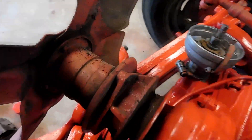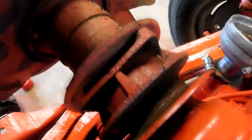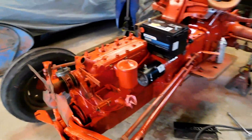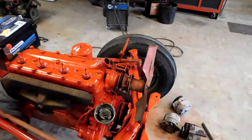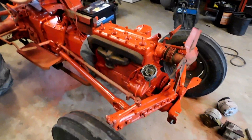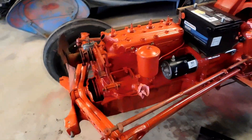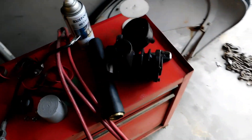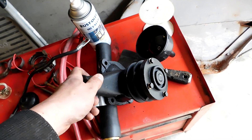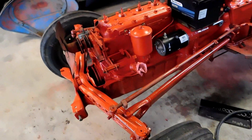This water pump has got some play in it. If I was using this thing on the farm and it wasn't going out swimming, I probably wouldn't mess with it — I'd just wait till it pops. But since this thing is going to be going into boat mode, I'd like to make a good impression the first time I take it out and not have my water pump come falling apart. So I've got a brand new water pump already on the scene. I'll just keep that old one for the other tractor, which also has a little bit of play in its water pump. I'll use the rest of the life up that this pump has on the other tractor.